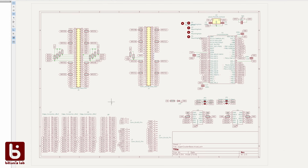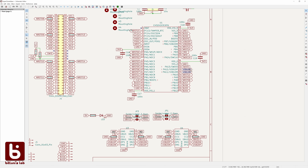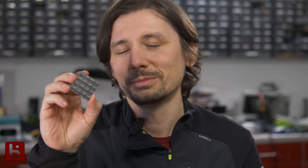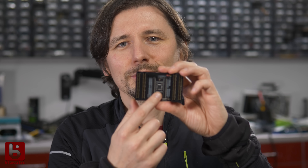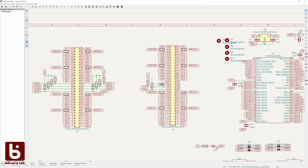The MCUs are on the front and on the back there are only two connectors, which are quite dense with 1.27mm pin pitch. After I had this design finished I continued making the baseboard, which is basically a carrier that interfaces all the MCUs. It just has this big brother RISC-V MCU on there. The plan was that this bigger MCU would feed data to all the small MCUs so they can carry out their tasks. It has native USB so it's easier to handle. Being able to program all the MCUs over the debug pin was always a concern of mine. I thought that if I control the reset line from the bigger MCU to each of the smaller MCUs I'd be able to use only one debug line to program each individually — that was a misconception, but more on that later.